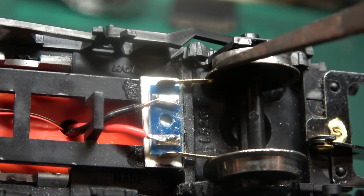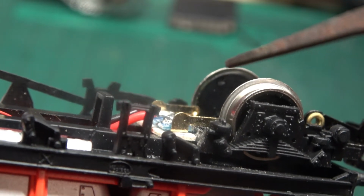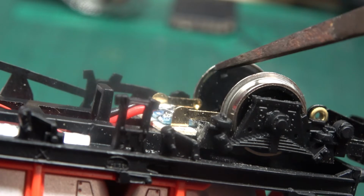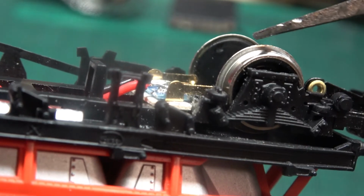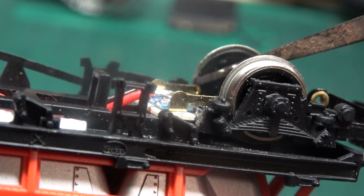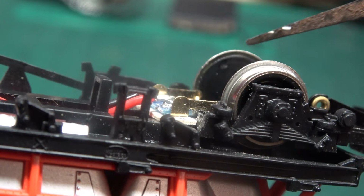And it gave me the right distance because these wheels, if you look, see that silver bit? That is the metal part. The black piece is plastic. So the wiper's got to be on the metal part. So you've only got about 2 millimetres wide. So that wiper's got to touch that outside, last 2 millimetres of the outside of the wheel.